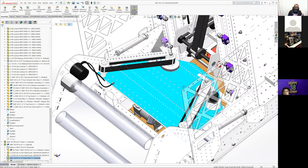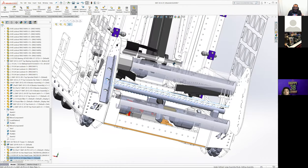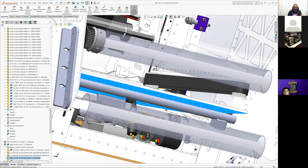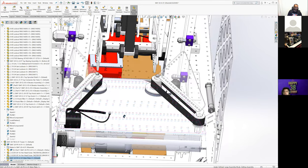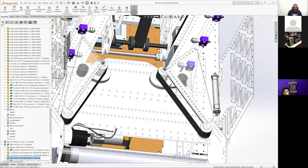And then it was a matter of, okay, if we know we're doing a V-funnel, how do you actually go through and choose all the little implementation details? I think our original prototype was hex shafts, and they had a second plate down here to support some bearing plates and to support some movement off of reverse planetary and things. It all just gets more complicated when you have live axle things and you're supporting the shafts, assembling them, and moving those shafts in and out of bearings, which we try to avoid in any situation that we can. So for the construction here, we decided to use a dead axle construction similar to how we use the 7/8 shafts up here.